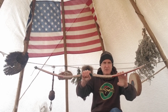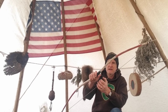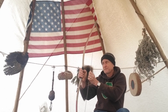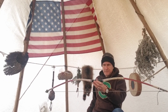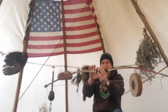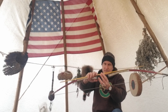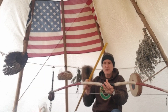A couple things here — you have to really rely on your eye. I've got a tillering stick in the pole barn, but I'm short tillering right now. I could hold it up to a mirror and bend it back. The bends in these things are beautiful. I've got these bends, and I can set them against, say, the edge of a floorboard — picture this is flooring, six-inch panels — and then see where these tips line up. That's one way to do it.